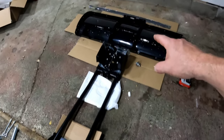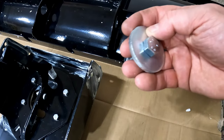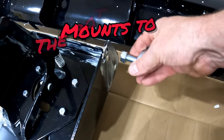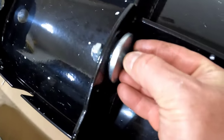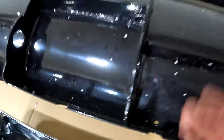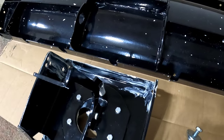Face your push tubes towards your plow blade. What you're going to do next is take your large washer and one that's a little bit smaller. This is going to mount through the hole on your push tube — just like that, you can see how the small washer fits in there. Push the blade up facing that and then mount it. Again, make sure to grease everything up so it stops it from rusting.